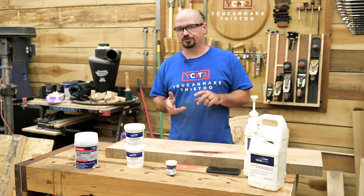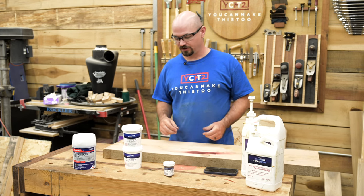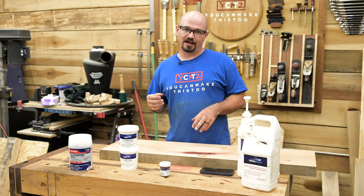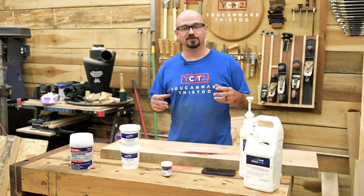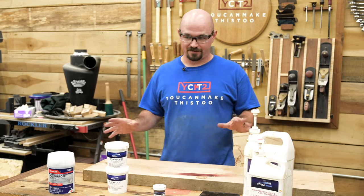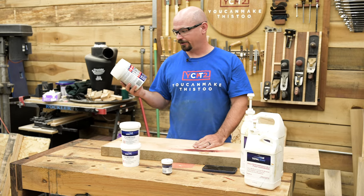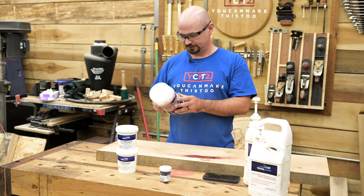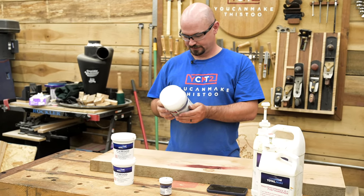So it's not a never — it's a sometimes — and definitely not if you're going to be staining or using an oil-based finish, especially over larger areas where you might see through the glue to the unstained wood, or where you're mixing sawdust in. Honestly, that's probably a never unless you're painting. The other thing about using those glues is they're always going to be small, non-structural repairs. Keeping with that idea of a repair with a pop of color where we're not trying to match it — maybe we're moving up to larger areas — we have some other options. Bondo or fairing compound is some type of resin — polyester resin, actually, as opposed to epoxy resin.